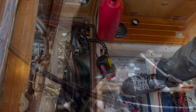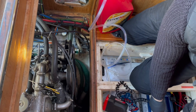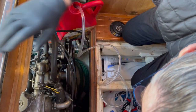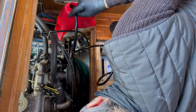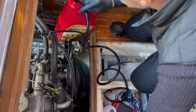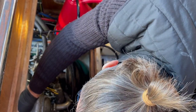I'm all excited to try this electric pump — I've never used it for this before. You just clip it on the batteries; one pipe is sucking and the other pipe is blowing. Put the blowing pipe into an old oil container, connect it up, switch it on, and it should get on with the job. Now that the pump's running, I'm checking there's oil coming up — you can see it running the length of the pipe and into the waste container. But then I realised the hot oil going through these soft plastic pipes has made them really floppy, changing their structure — they could fall out of your waste container. The pickup pipe, more like washer pipe off a car, has turned to jelly almost, so I'm going to have to give it up. It was good to try it, because at least I know it doesn't work now.